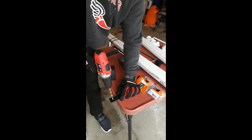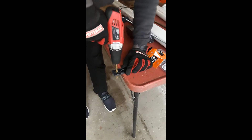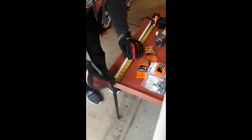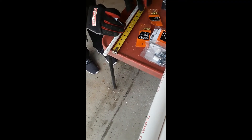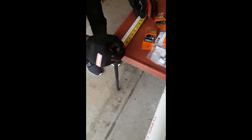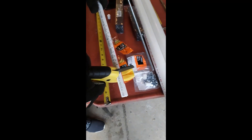It's a little bit hard to get it started, but once you get it going, there you have it. That's what you've got to do for each one. Next, what I'm making are spacers so that the piece between each of the shims will be exactly one inch. I'm going to make lines every half inch and then use a PVC cutter to cut these spacers. This is a standard PVC cutter — just make sure you're on the line, and then snap it right off. Very simple process.